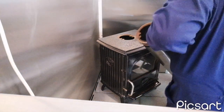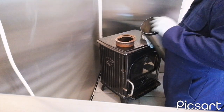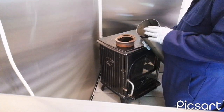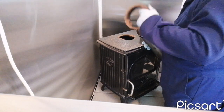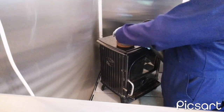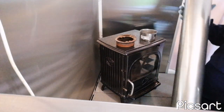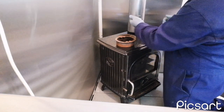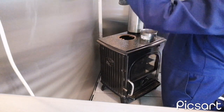Right, so there we go. What I did first was cut through it with a hacksaw. I then ground down all the lumpy bits — because my cutting's as good as my video making. I finished it off with a round file just to take off the burrs, flatten it out and make it relatively flat. Now the collar does fit in there. It's a little bit tricky to get in but it does fit. I'll probably put the fire cement on first and build this and then screw it on from inside, so I'll be able to get the fire cement on top of the collar.